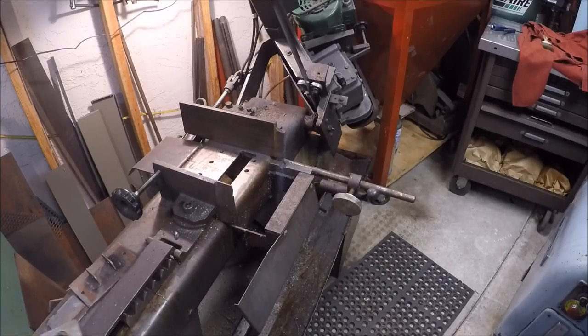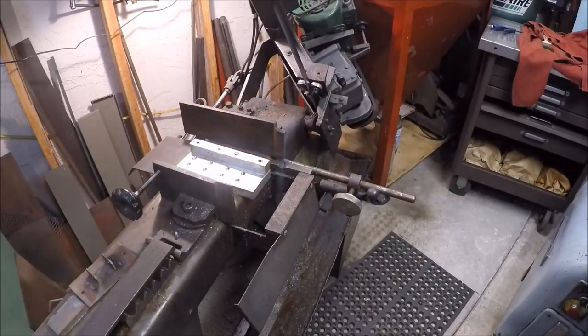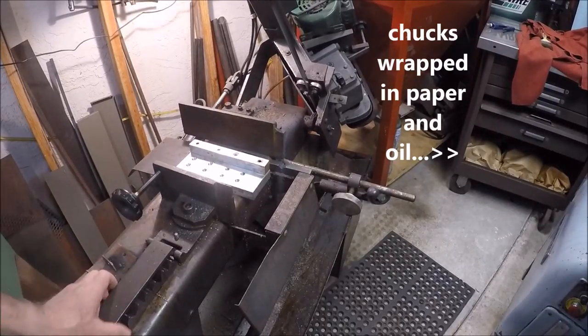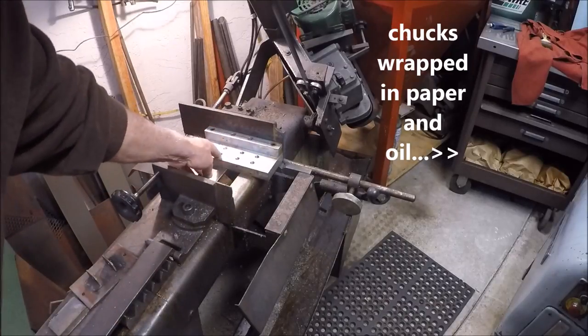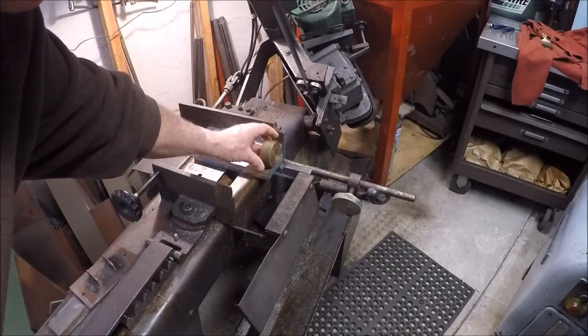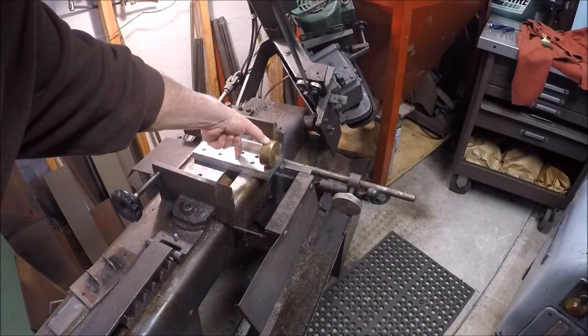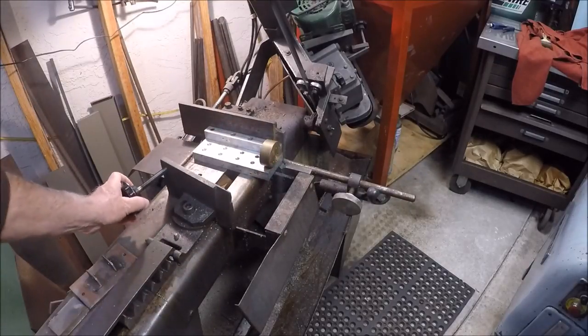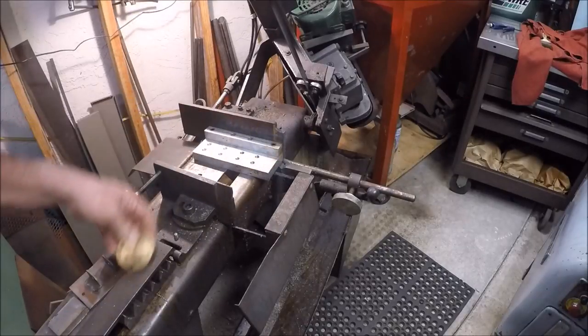This is a piece that I made some time ago for my bandsaw when I needed to cut something that would not fit in the slide vise. So this guy would sit in here — there's a fence. A little round disc like that could sit on there, use regular mill clamps to hold down, and you could slice off just a little edge if you wanted to. No way to hold it in the vise.